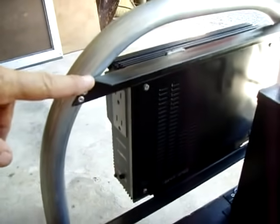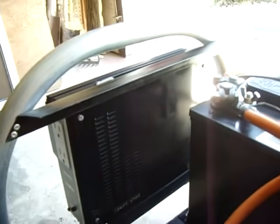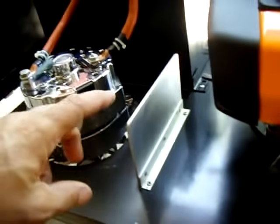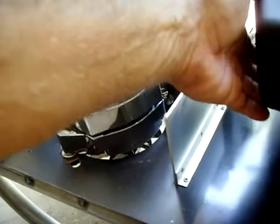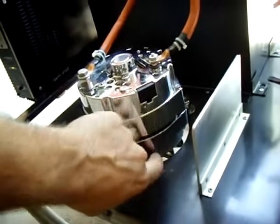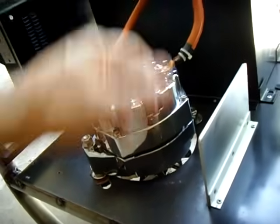I fabricated all these plates, and the inverter is riveted on. This is a deflector shield to keep the heat from the engine from blowing towards the alternator, and the fan on the alternator puts out a tremendous amount of cooling air — it flows right through it.